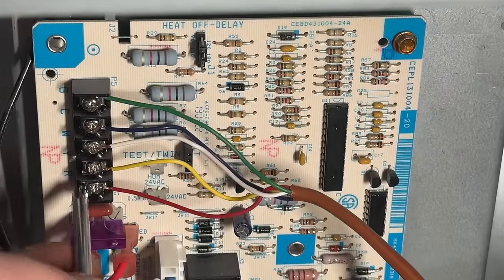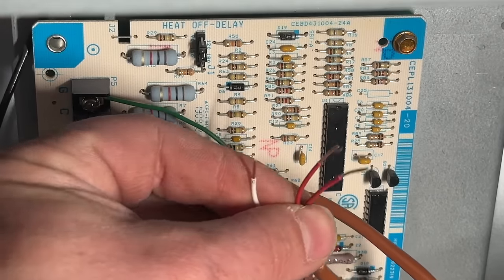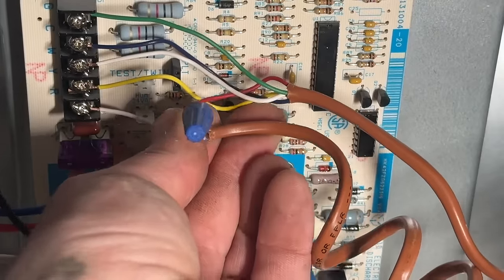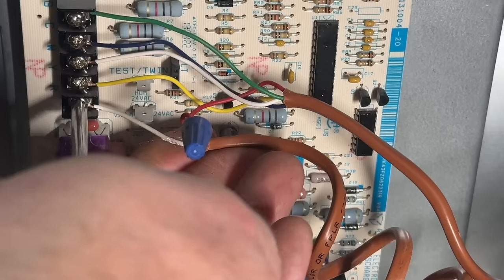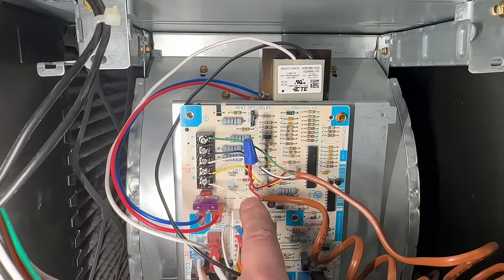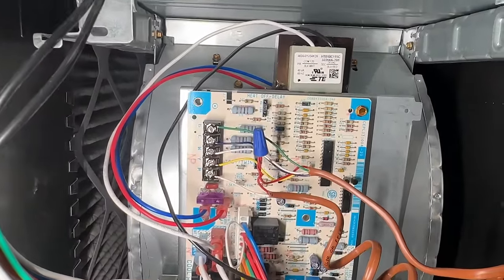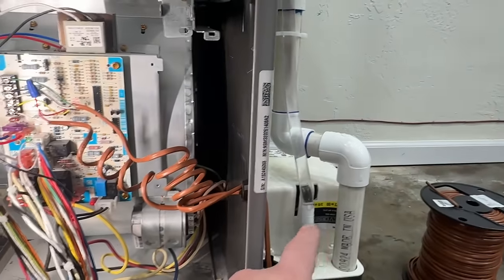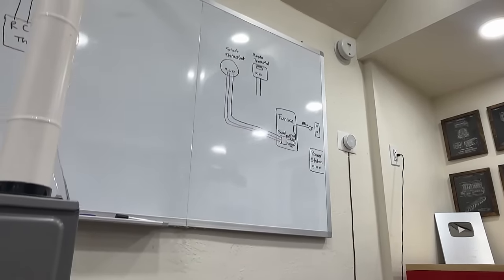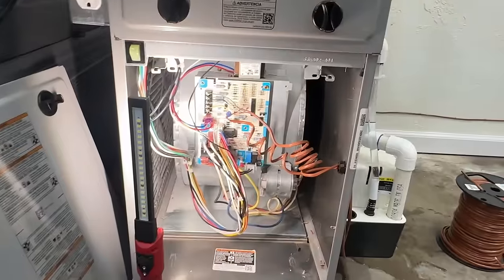Now that we have our wires ready, we're going to take the red wire off and wire nut it to the red wire here, then take that white wire and connect it where the red wire was connected — and that is literally it. We've now successfully wired this in. Once we power this up, we're getting power to this white wire, it's going through the condensate pump, and then it's coming back to the red wire, which goes to the thermostat. So if for whatever reason this contact is broken — if that motor fails — the red wire going to our thermostat will no longer have power and everything will shut down. You will know 100% that you have a problem, but you will not have a flooded space. That's exactly the purpose of that switch.